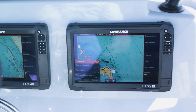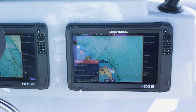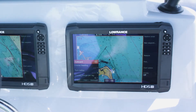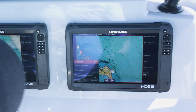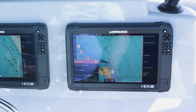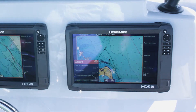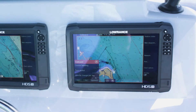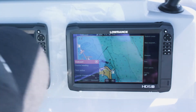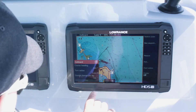We can tell it anything we want — the course heading we want to start on, the turn radius, how big we want the turns to be. Right now we're showing a course heading of 98 degrees, a turn radius of 164 feet, and per leg of that course change is 40 degrees. So when we make it out 40 degrees it's going to change back and come back the other way. I can tell it if I want to start on the port side or the starboard side — today we're going to start on the starboard side.